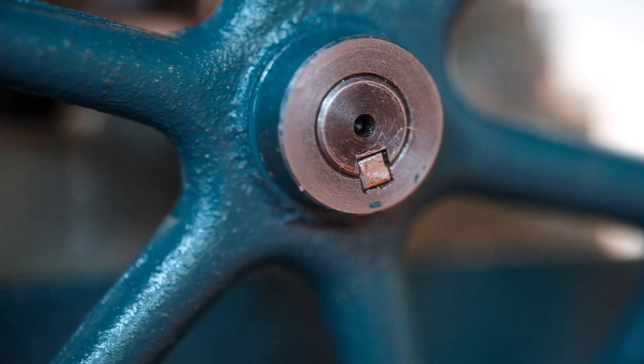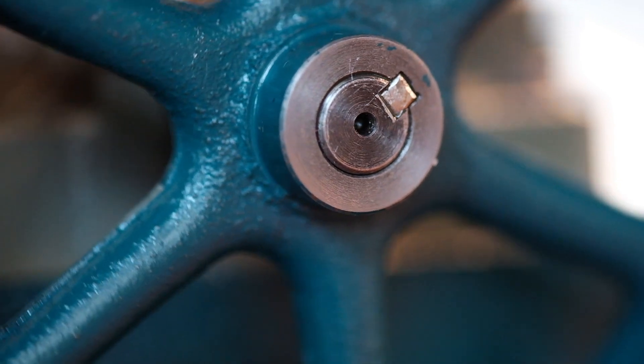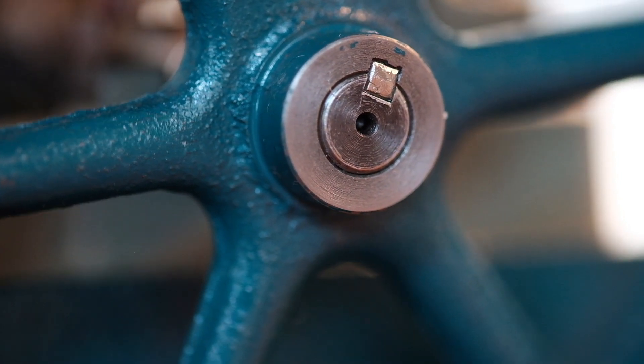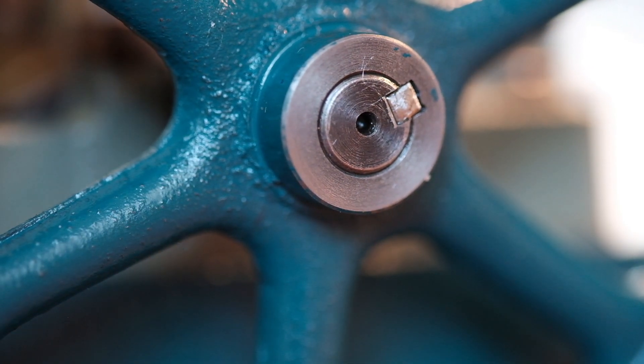This is how it looks on the actual steam engine. If you want to add an extra touch of realism, drill a tiny hole in the end with a center drill — that makes the shaft look just like a real shaft on an industrial machine, which has center holes in the ends for turning between centers on a lathe. So there you have it: a practical and relatively inexpensive way to attach flywheels to your little steam engines in a very functional manner that looks good. Thank you for watching.